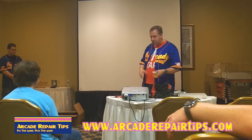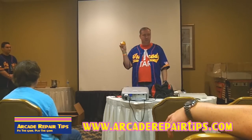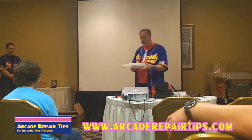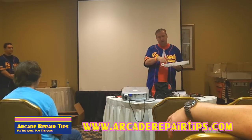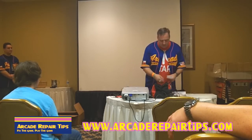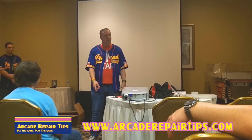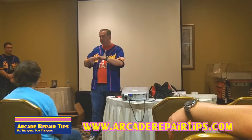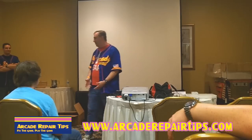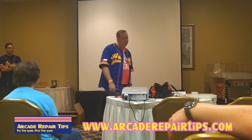Solder — everybody know that Gene is selling this at a good deal here, way cheaper than you can buy it anywhere else. I like these little tackle-style kits to keep connectors and fuses organized. We like it when we open a game and they say don't worry, and you can see the fuse is really toasty — or they've used a Wrigley's gum wrapper as a fix. The more I repair games, the more I don't just say 'oh, it's only a fuse.' Now I ask: what made the fuse blow in the first place? So begin to get a little deeper in your repair than just popping fuses.